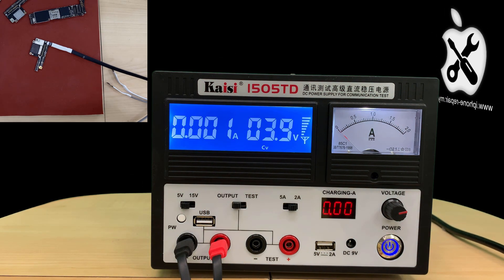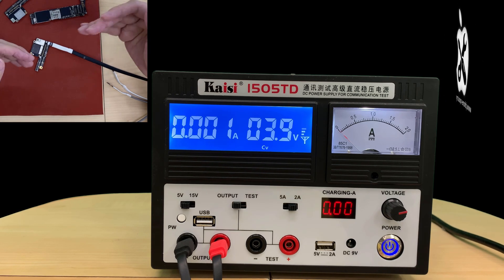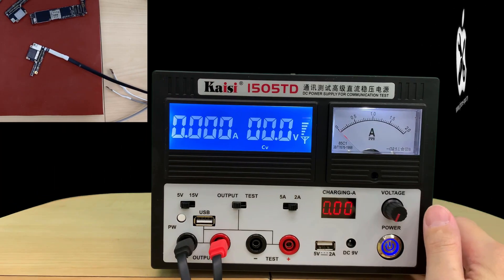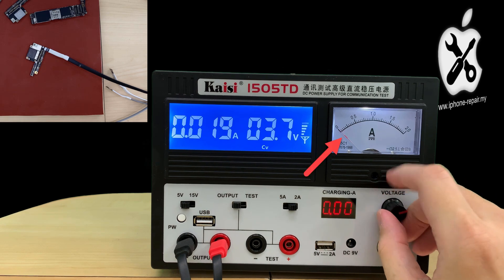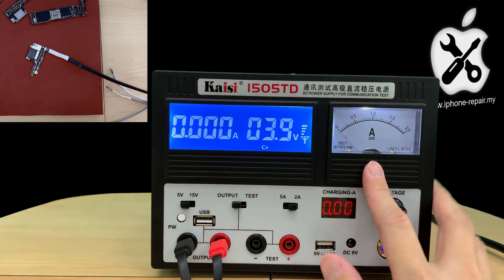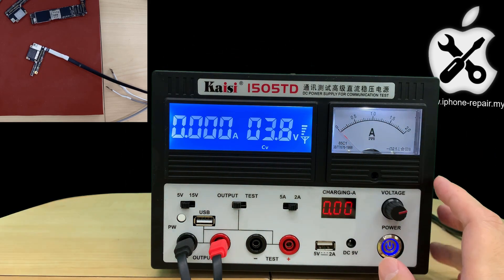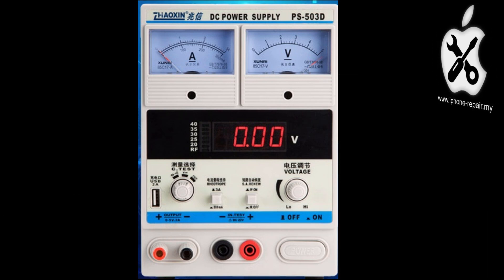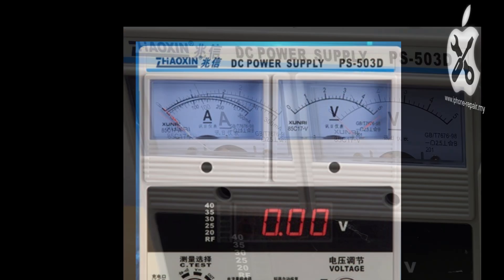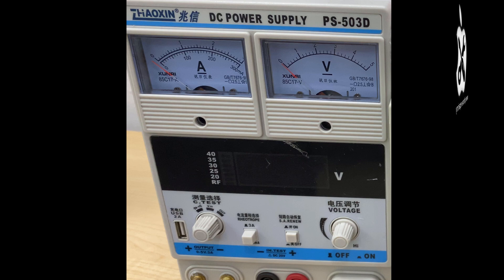This is how we test it. It will attempt to boot but without the CPU it doesn't react at all, yet we can still notice the difference from the current drawing. This is another way to check if you have doubt about the power IC — without the CPU, you can do this. If you want to try, look at the analog — it's really hard to notice the difference unless your meter has a switch for a range below 300mA.